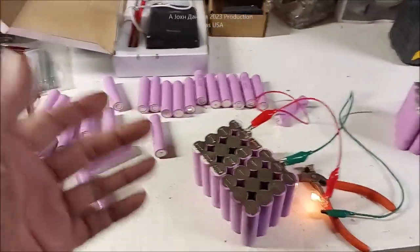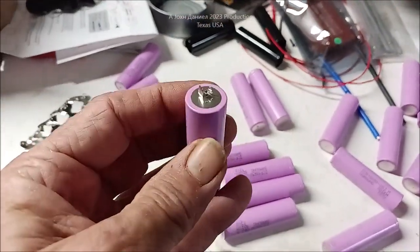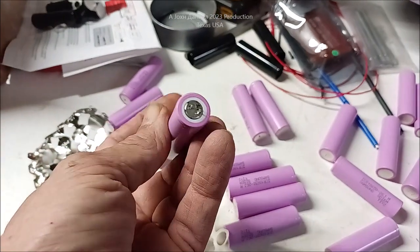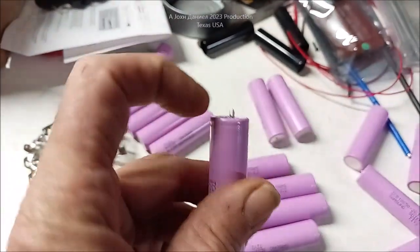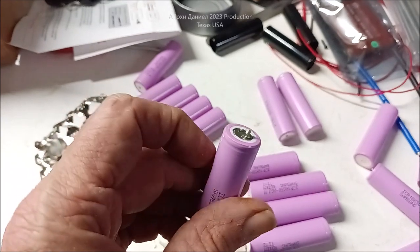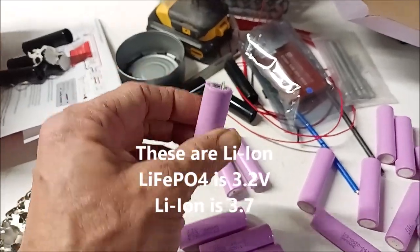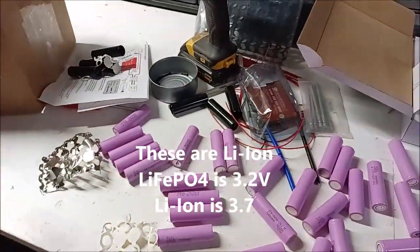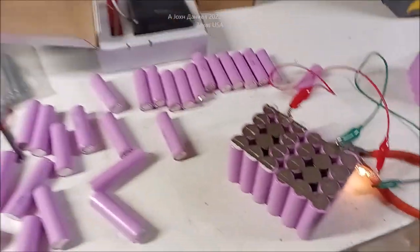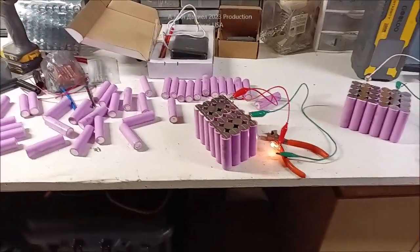You could even have one blow up in your hand. She's done a pretty clean job, but if that side were to touch the outer casing — there's a little bit left on that one — say that was to touch when you're pulling on it. You can't pry on these, you have to pull straight out. If that were to touch, that would create one heck of an arc. It could damage the battery and even cause a thermal runaway. It's a little different — 3.7 volts versus 3.2, which is a bit more stable.